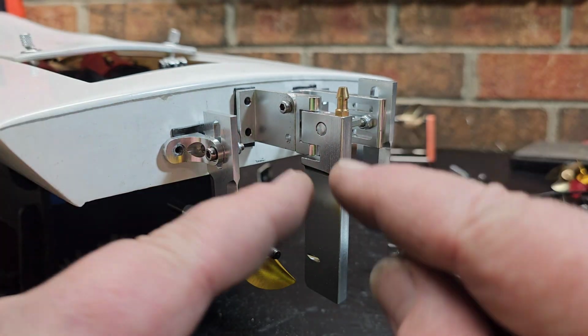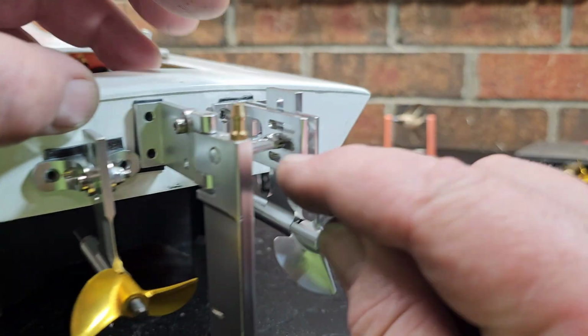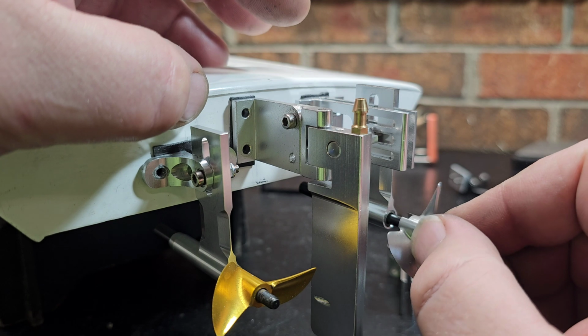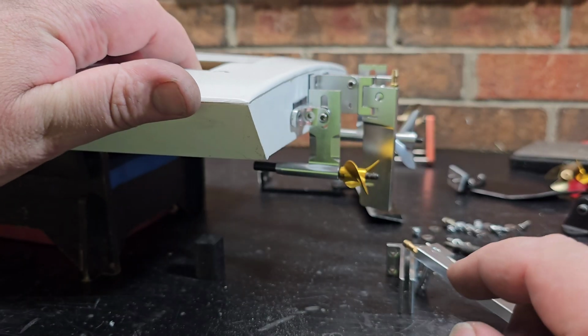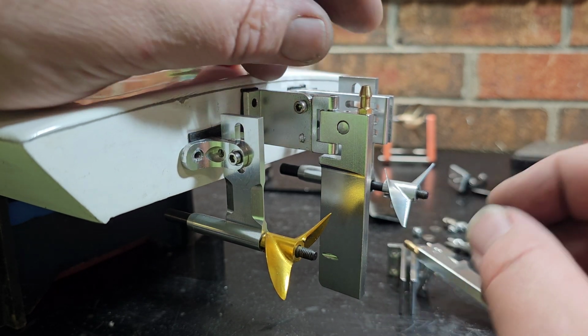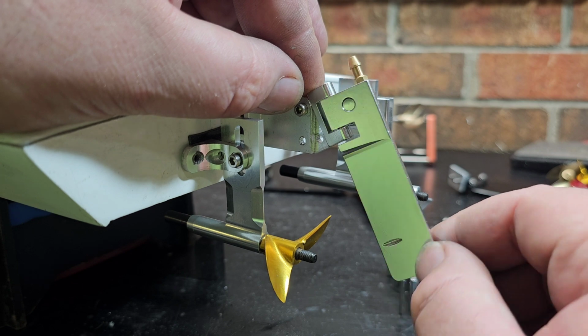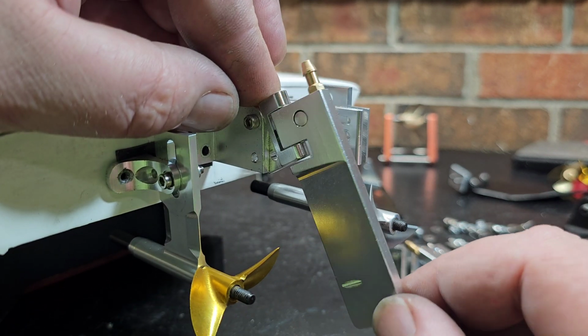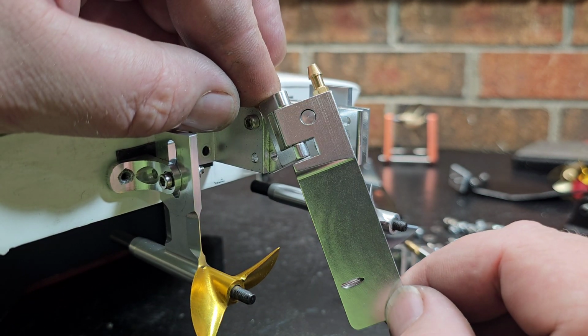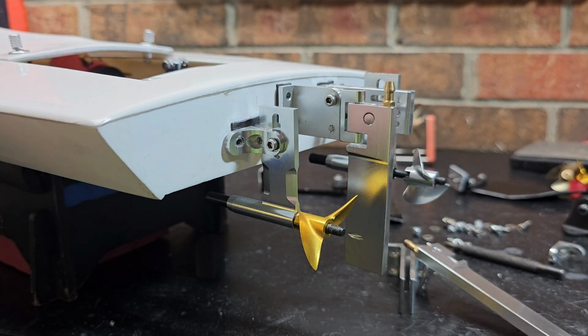This whole rabbit hole, I'm talking, I went down it, boy. So with the rudder bracket short, I can run these struts in their forward position. It brings it a little bit closer to the transom. They're not fully extended, and it won't hit the rudder, and it may actually work out better when it kicks up, because the props will almost be in front of the swing on the blade. So yeah, I'm done with that.